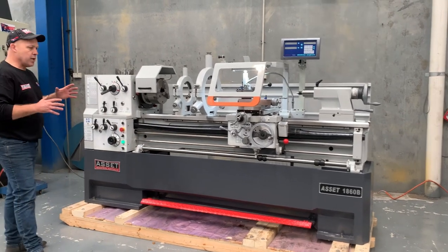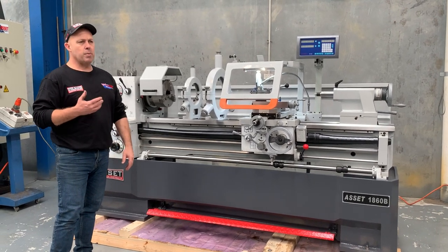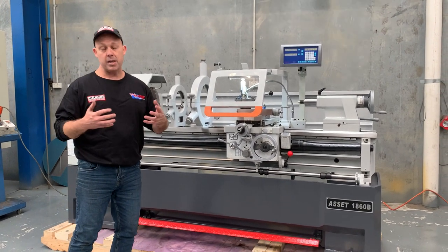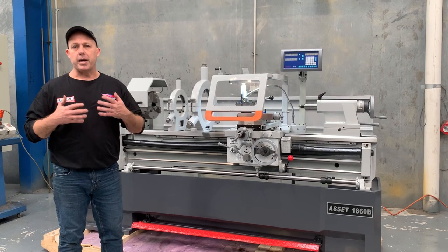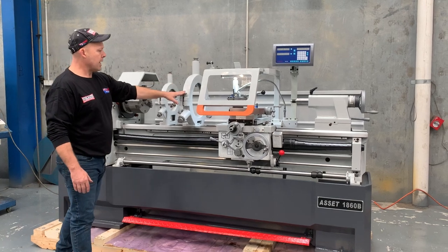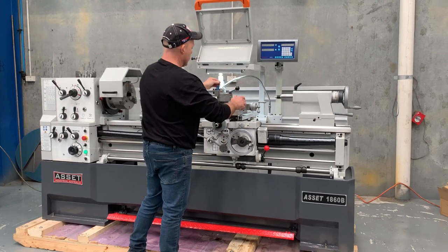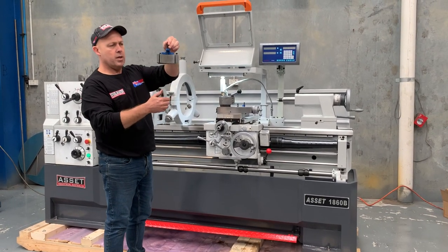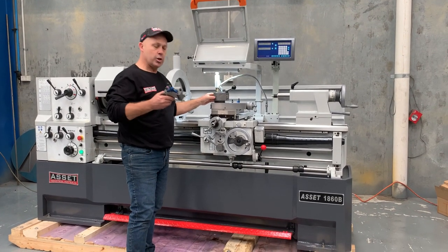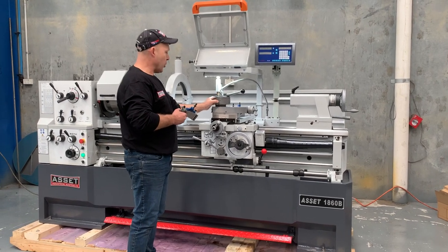This is our new Euro model that's become very, very popular within the Australian metalworking machinery market. What Asset Plant and Machinery do is look at the marketplace and basically say what can we put more onto our machines to make them better than the rest but at a competitively priced B2B level. So what we do is we put two fixed steadies — a small steady and a large steady. We also have a really good quick change tool post system. We have the multi-fit Herries type quick change tool post. You get three holders with that — two turning and one boring — and the good thing about this quick change tool post system is it gives you full indexing of your turning tool when you're turning.